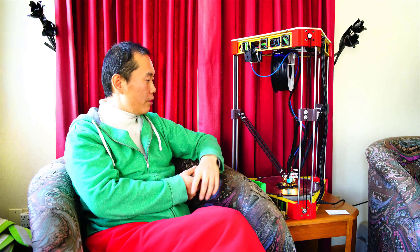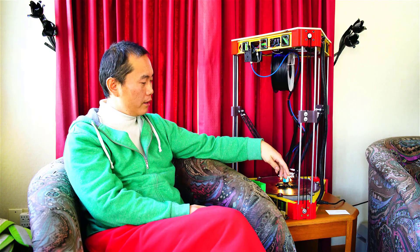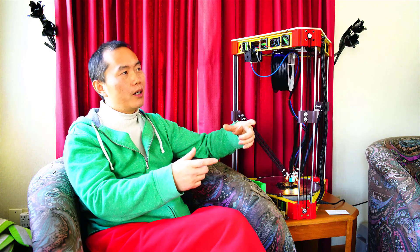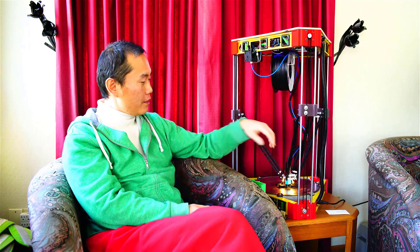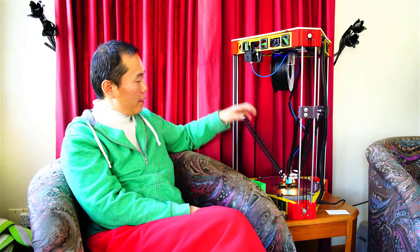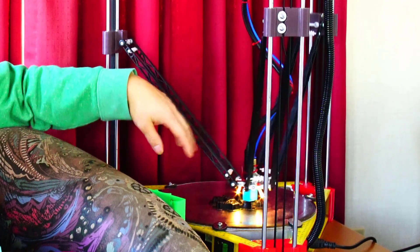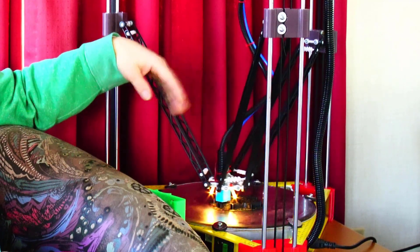Other than that, it's pretty much the same. We have a heated bed — 300 watts, silicone heat bed, running on 110 volts. The 110 volt is way quicker to heat up than 12 volt, so this bed heats up very fast. And the middle part is a classic semi-CNC delta arm. I'll probably replace it with carbon fiber later on.